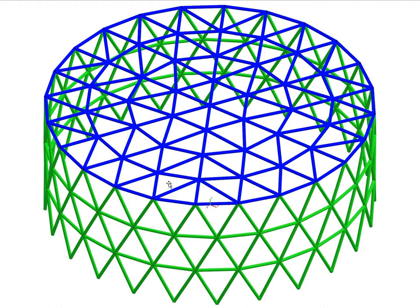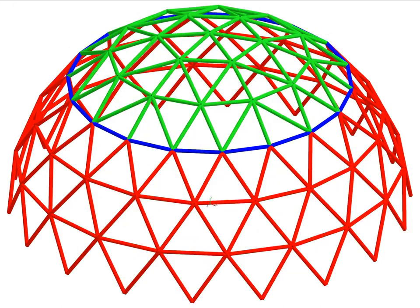And now you can imagine this dome warping, where we sort of take this flat surface and we bulge it upward, and then we also come along and we mash inward right along this edge, so that we take this shape and we evolve it into a continuous curve typical of a dome, and basically halfway, angular wise, halfway up the dome, we convert from a lamella pattern, which is for the more nearly vertical part, to the pi sector pattern, which is for the more nearly horizontal, and that's what that looks like. Now, I don't have morphing software, so I'm going to show you how to generate this particular geometry.